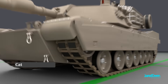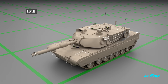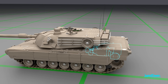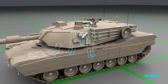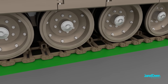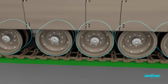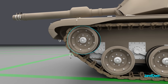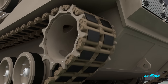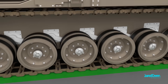Let's look at some of the features of the tank. We have the caterpillar tracks, the wheels — there are seven on the ground on each side — the main body called the hull, and the turret, which is the part that spins on top and holds the weapons and other equipment. The engine is housed in the very back. Now let's look more specifically at the caterpillar tracks, sometimes called tank treads. They are made of steel with replaceable rubber pads. There are seven road wheels on each side of the tank, a raised idler wheel in the very front, and the drive sprocket in the back. The drive sprocket has gear teeth on it and is the only one powered by the engine — it moves the entire track along. The other wheels spin freely as the tank treads move past them.